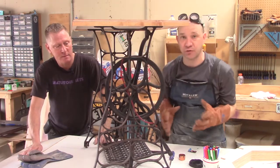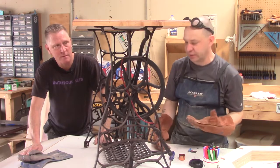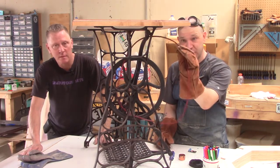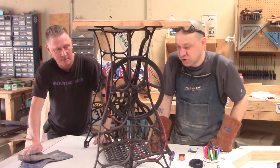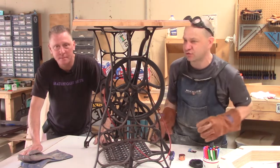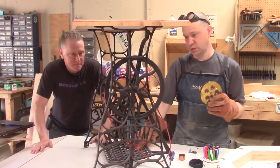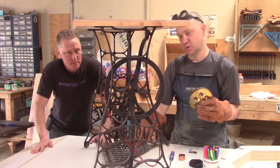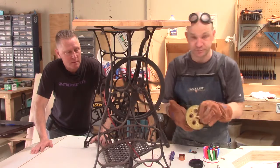I spent a lot of time looking for the drive belt for this guy, looking at various V-belts and whatnot, and it turns out they still just sell the leather bands that originally drove this when it was a sewing machine. You can adjust the length on your own, and the leather is kind of just the perfect amount of stretchy, and it's working really well. This wheel will, as it gets going, drive this guy up top, still in frame though, up top there.